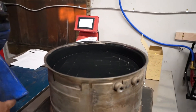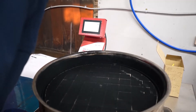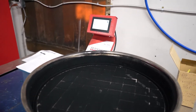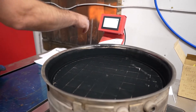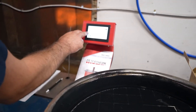We did the light test on this filter - didn't see any structural damage, didn't see any light coming through at this point. It is pretty dirty, and there was another concern which I'll show you once we flip this over - that's why we ultimately decided to put a new filter on this unit. I don't see any light in it, so that's a good thing. I'm going to turn the light off and now we're going to turn the fan on.